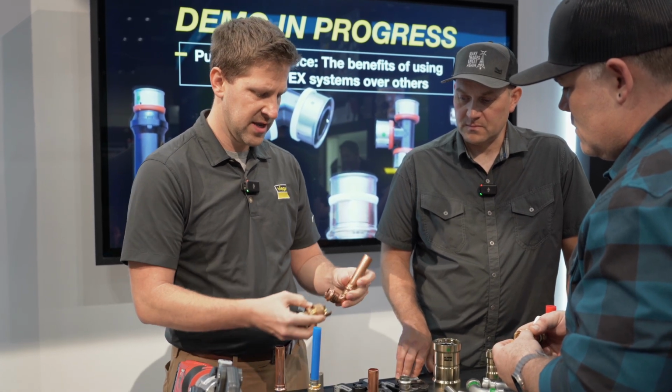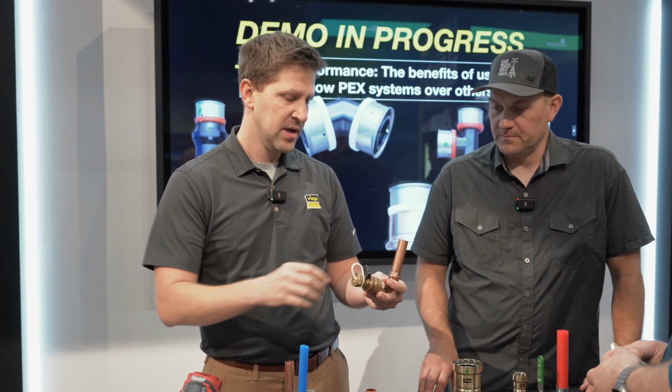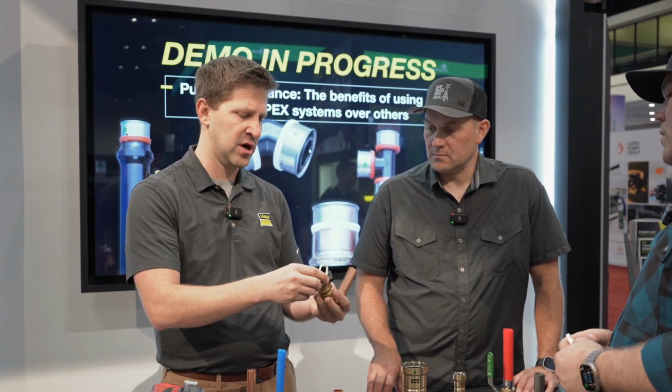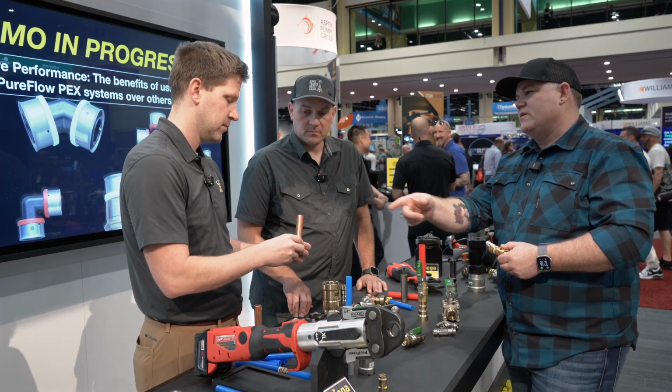So you just throw this on there and you've got your temporary seal up to 200 PSI. So I'll just have one of these thrown in the tool bag, pull it out and have a gauge on here, throw another valve on there. This also has the opportunity to put a hose on here if you need a drain, anything like that. But it's a 1/2 inch pipe thread.